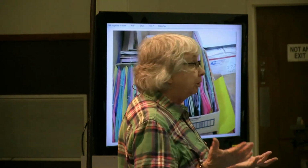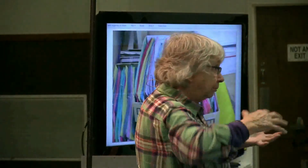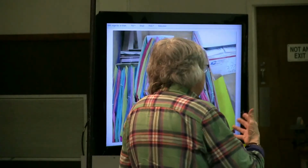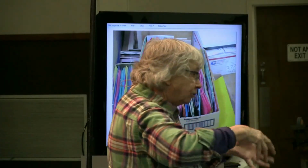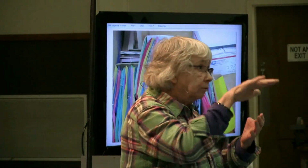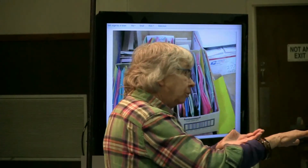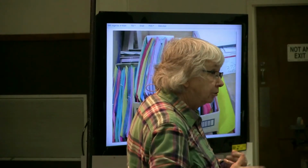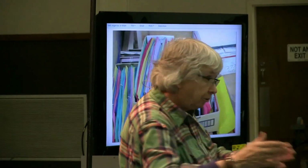My working size is 3.5 inches by 16 inches long, so I have all my veneer already to that. I will get 12 pieces. Currently I'm putting twine in between each piece to try to make it so it dyes more equally. It sort of works, not really, but sort of. And so I do batches of 12. And that's pretty important as you're going to go through my work here. When all of a sudden you see the same orange all the way through a project, you know, you got to have enough to do it, because orange A is not going to be the same as orange B.